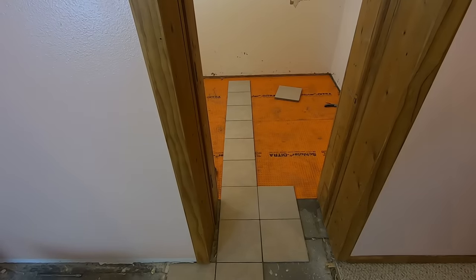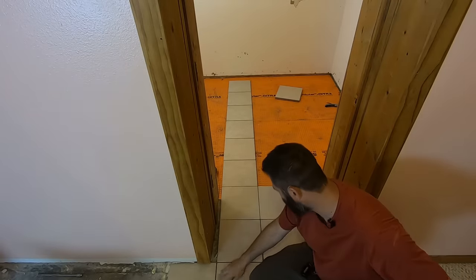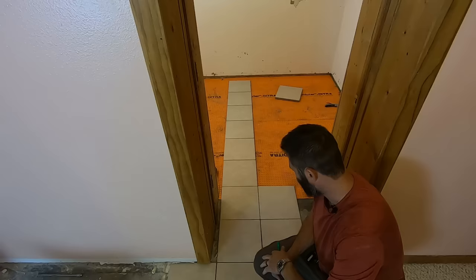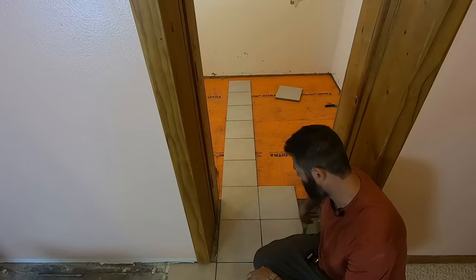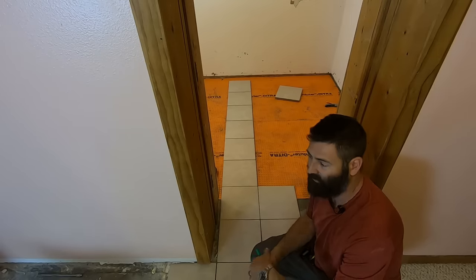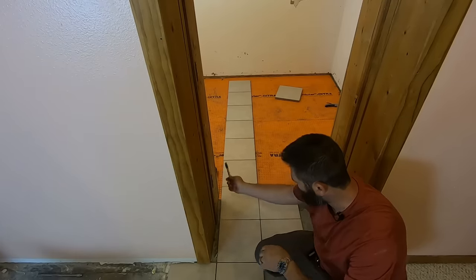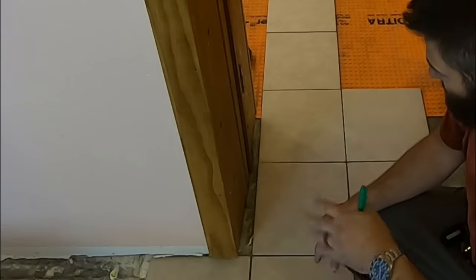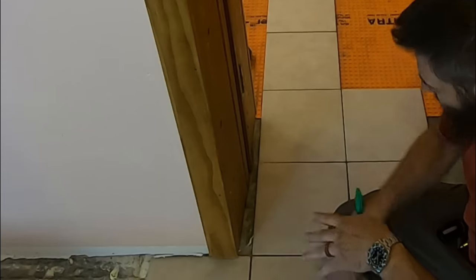Here's an example of something you want to try to avoid. I'm just putting tiles down, measuring off of this wall, to see how they fit. From here to there you can see we've got a little skinny piece here and a wide piece over there. You want to avoid that, so this grout line will be set in the center. I'm going to adjust it to the center between the door, then lay some tile going that way and this way and see what I end up with. If there's a tiny sliver behind the toilet — no big deal, no one's ever going to be back there. This doorway here is not 90 degrees to anything, and unless you pull the door jam out and fur it out and shim it up to be perfectly straight, that's the only way it's going to be straight.